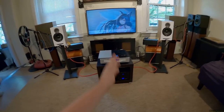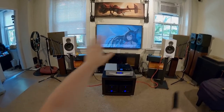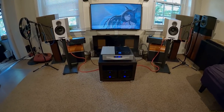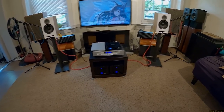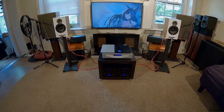The reason I'm bringing this up is because several times I've had to check why it sounds like everything's coming out of the center — I keep thinking I'm playing in mono. The imaging is so uneven: where sound should spread across the entire front space it's just — right there. That ball of sound is right in front of me, back ten feet. That doesn't bode well for enjoyment. JBL 306Ps destroy these in imaging, and this has more detail shooting out of it than a 306P — but at least the 306P moves the image. These sound like locked-down speakers.